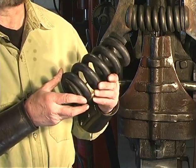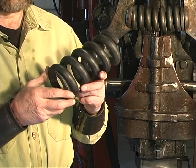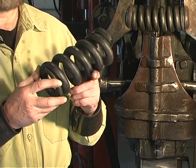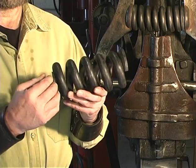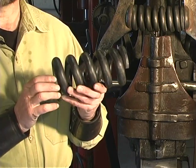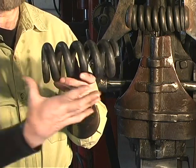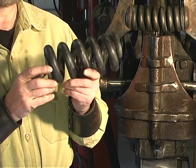It's necessary to understand spring rate in coil compression springs. Spring rate is expressed as pounds over inches. The computer program I use rated this spring with a spring rate of 6,912 — expressed as 6,912 pounds of pressure to compress this spring one inch. The relationship is linear, which means to compress it half an inch would take half that amount, about 3,500 pounds; to compress it two inches would take about 14,000 pounds. It's possible to work out how much energy is stored in this spring if you know the spring rate and the maximum compression point at the top of the stroke. This spring in the hammer was compressed about 3/8 of an inch at the basic setting when the ram was picked up to working height, and with the original links it only gained another 3/8 of an inch of compression at the highest point.